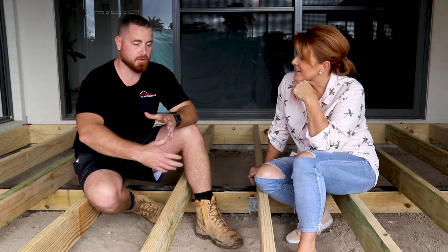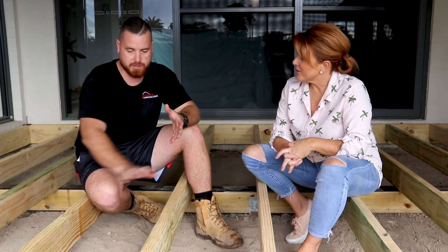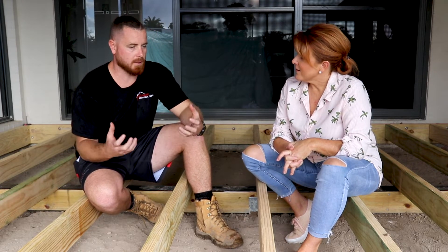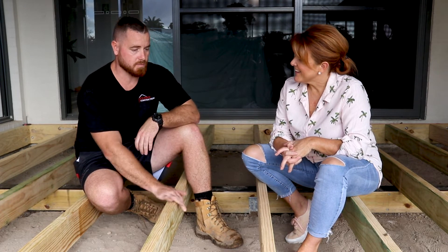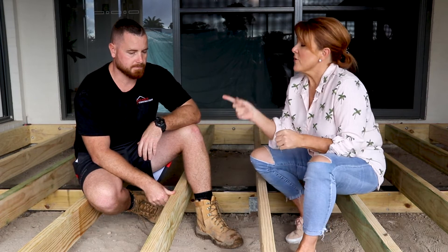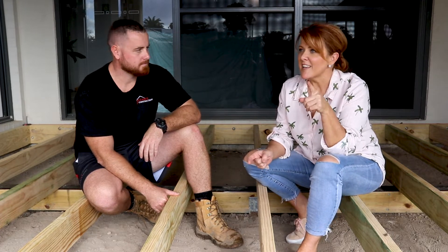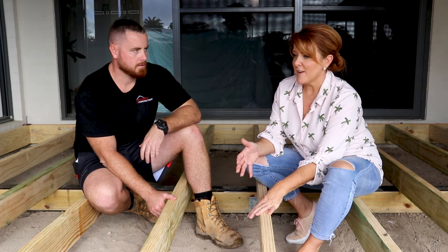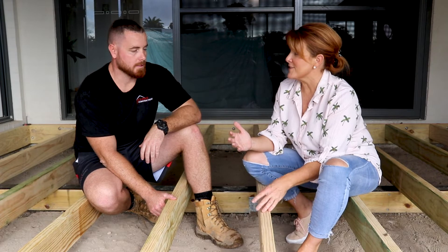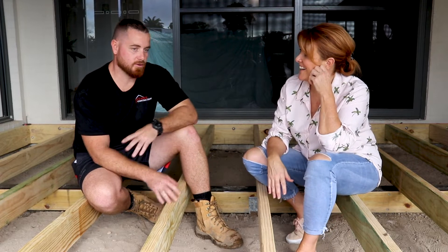If the builder comes in and has a look, you could put some solid blocking through the joists to structurally make the subframe stronger — or potentially replace the joists with a bigger joist. And the Trex Transcend boards are very straight, so you need to make sure your bearers and joists haven't walked or moved over time, because putting a straight board onto a wobbly frame could be a recipe for disaster — and then it all goes downhill from there.